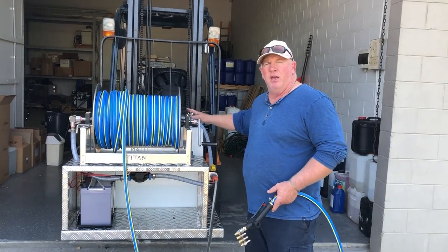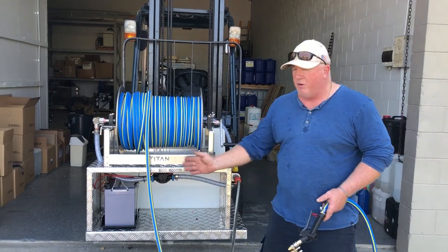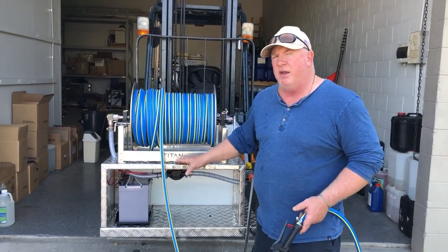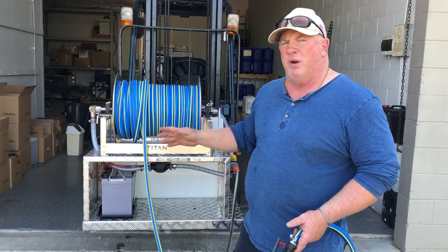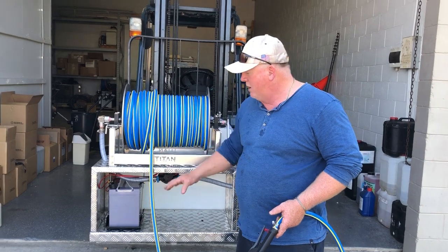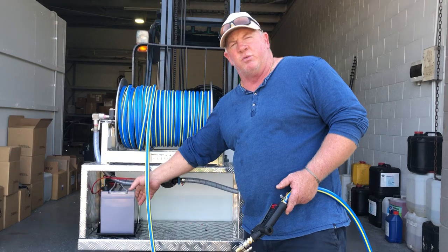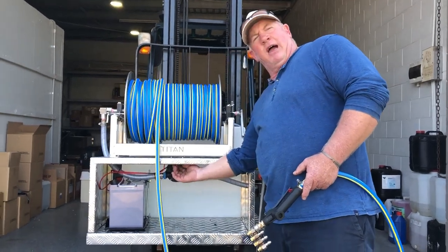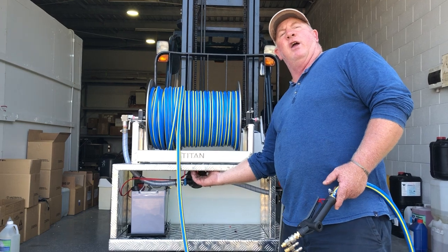It's a 150-litre batch system down to a three-way ball valve and simply through to a six-gallon-a-minute Versa Jet — so it's the slightly bigger unit, up around about 27-28 litres a minute at 70 PSI. We've got the big 100-amp-hour deep cycle battery in there as well, and we've set up a simple little breaker unit here that just allows us to switch that on and off really simply.